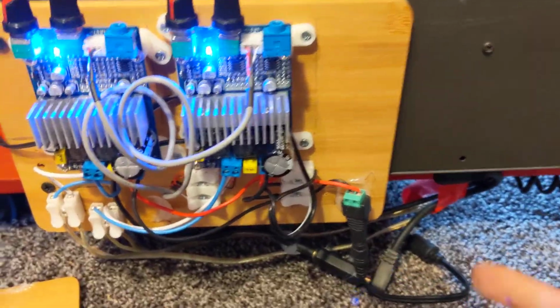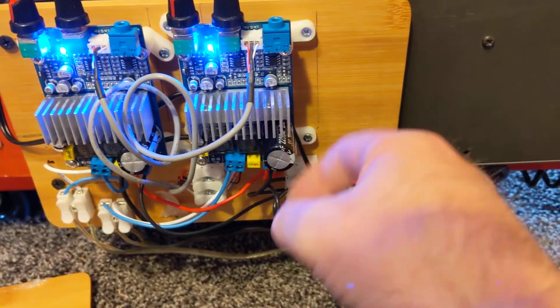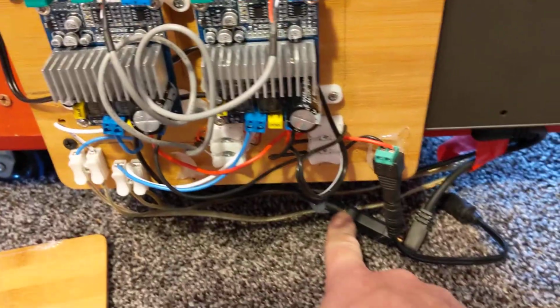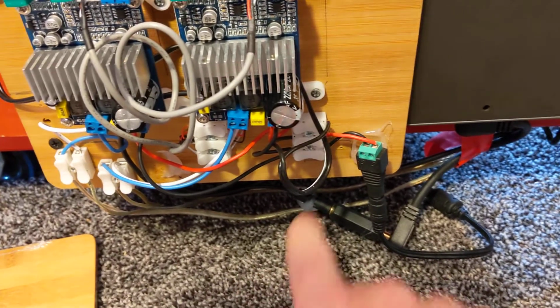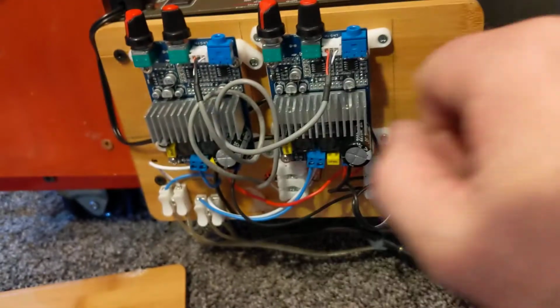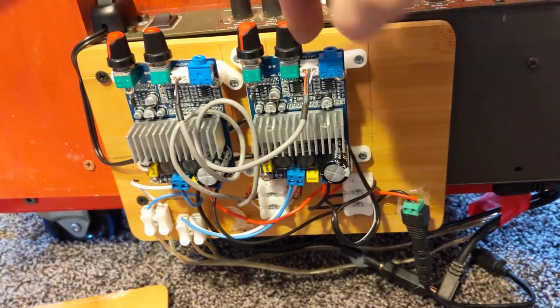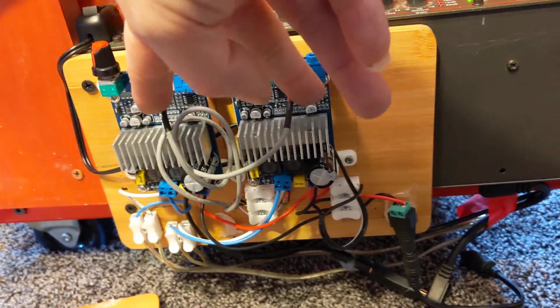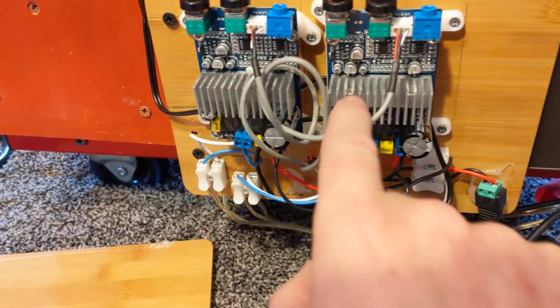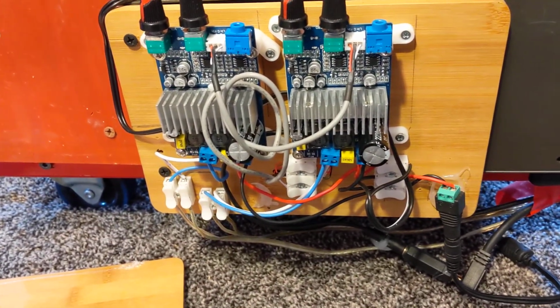Let's look at the circuit board in more detail. So, I have power coming in here, going through a block that is passing through this switch so that I can just turn it off if I want to. I've got an audio in, which was glued on but has come off, now dangling. So this is connecting power to the two. This is connecting the incoming audio, and then these little cards, you can either put a jack in one of these, or you can connect using these Phoenix connectors. So I have the 3 left, right, and ground going in here, spliced to here so that it's just split and shared, and then out to, that's the speakers for that one, and that's the speakers for that one. Pretty straightforward.